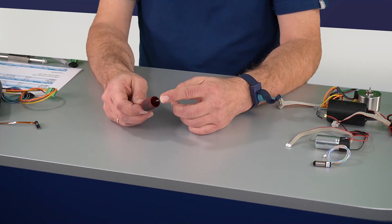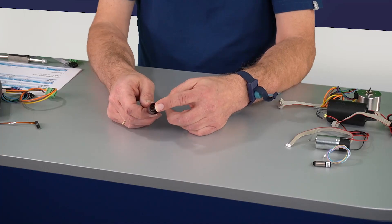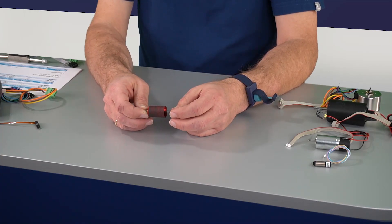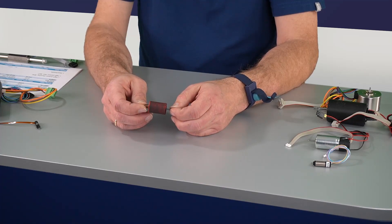So let's start with the motors. Faulhaber motors usually use the coreless winding like here. This core technology is the key for having high efficiency and absolutely no cogging torque, and that's used not only for the DC motors but also for the brushless ones and even for the direct linear ones.